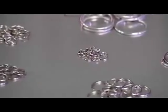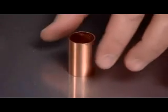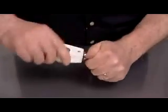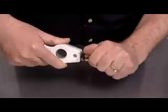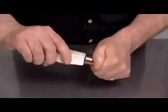The goal of brazing rings is a consistent and repeatable joint quality while controlling alloy usage. The first step is to clean the tubing and the fitting. The parts should be properly cut and reamed to remove burrs. Cleaning should be performed so that surface contaminants are removed without unwarranted loss of base metals.